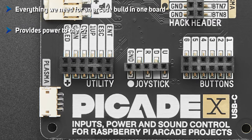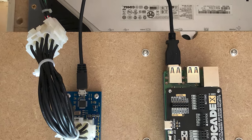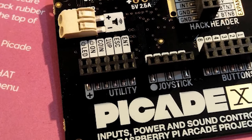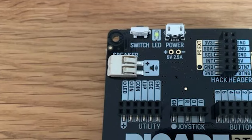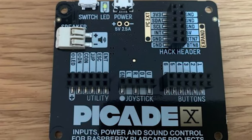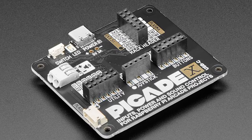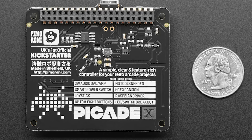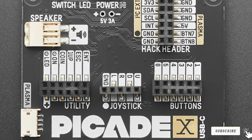The Picade X-Hat has a USB port that it uses to provide power both to the Pi itself and to any speakers. The latest version uses a Type-C connector, which means it provides enough power for either a Raspberry Pi 4 or an earlier model. Older versions, which may still be on sale, use a Micro-USB connector that only has enough power for a Pi 3 or earlier after you install a one-line script. The Picade X-Hat works flawlessly in popular emulation platforms such as RetroPie and Lakka, both of which see it as a keyboard where you assign each button to a function. One potential issue is that gaming puts a load on your processor and the board covers your CPU, which can trap heat — a particular problem for Raspberry Pi 4s. If you use a stacker to raise the height, you can put a fan or heat sink below it.